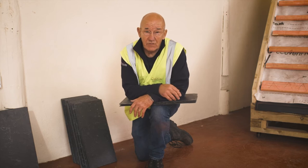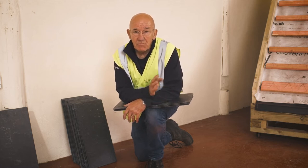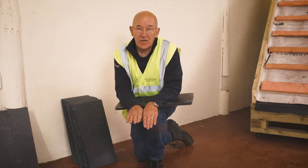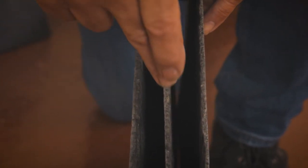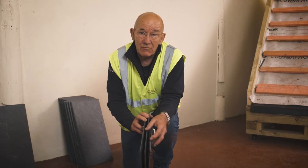What I'm going to show you now is how to grade your slates into thick, medium and thin. When you grade your slates into those sections, the thick go on the bottom, medium go in the middle, thins go on the top. That way you have a chance of them going down flat without getting what we call kickers. A thick slate beside a thin slate is a kicker. I've got a little selection here which will show you a thick, medium and thin slate. It's still not easy to tell because it is subjective. Even after grading the slates you can still get a rogue slate in there which will kick it up. Because of that you need to be watching what you're slating as you're slating. If you see one that's going to be a kicker, take it out and do it again. The roof is going to stay up there for about 70 or 80 years — you want it to look good for the whole of that duration.